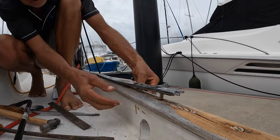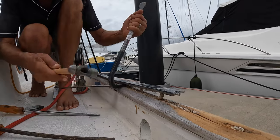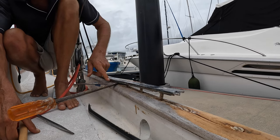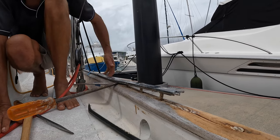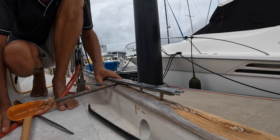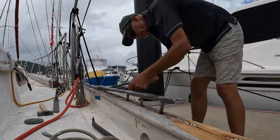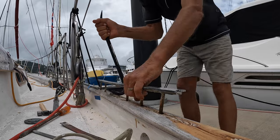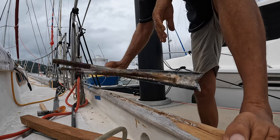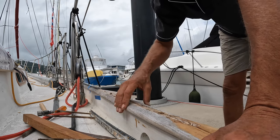The teak is not looking very healthy under there at all — must have had a knock in the past. It's split all the way along. In fact, this piece has been replaced before — there's a scarf joint there and another one back there. Normally these pieces are about eight feet long; this is a short piece, so it's been replaced. This could be a major source of leaking. This piece is going to have to be replaced.